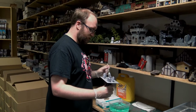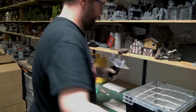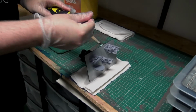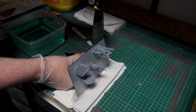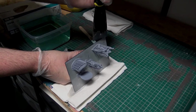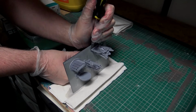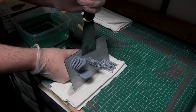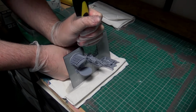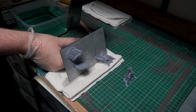There you go. So what we need to do first is get this off the build plate, and I need to grab a tool. This is the scary part, because you're always worried about breaking something. So get my scraper and very carefully, he says very carefully, we'll try the other side of it, wedge it underneath like that. Same there. Don't be too worried about this step, because the resin hasn't completely cured. It's still a little bit flexible.